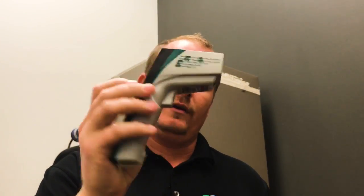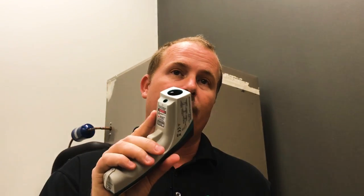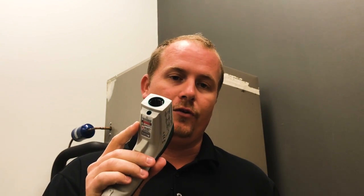That's a quick demonstration of the Refco infrared thermometer. I think it's a good tool to have in the toolbox — it's good to know how to use it and important not to use it in ways that will give you a false reading. That's where I see a lot of home inspectors and less experienced folks go wrong — just pointing it at a vent and expecting an accurate reading without adjusting for emissivity and without accounting for the fact that the measurement cone increases the further you are from the device. But once you know how to use it, it's a great tool. Thanks for watching.